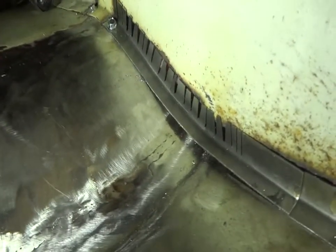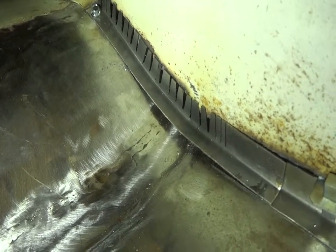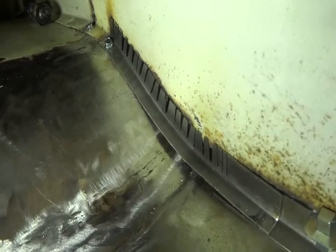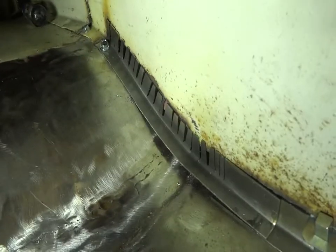After that, I'll take a piece of copper to the backside where you see my fingers through there, clamp it on, and tack it to the seat base. Then I'll pull this whole seat base off — it's screwed in with self-tapping screws — and start filling in these seams. I'll have to make some adjustments to the cuts as well.